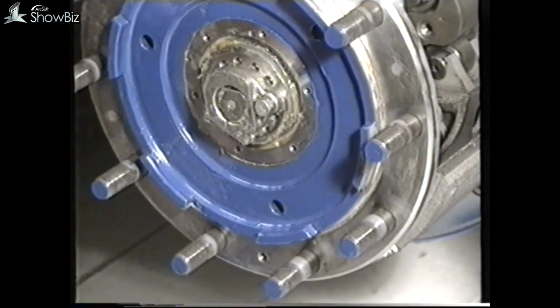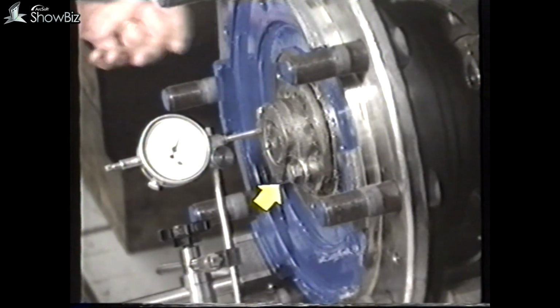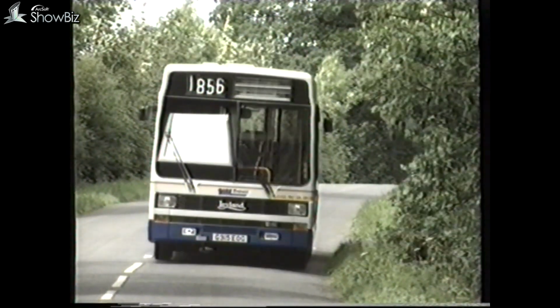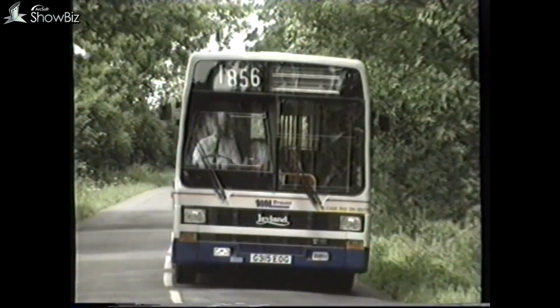After tightening the clamp bolt, recheck the clearance, as the clamping action on the stub axle threads may have moved the clamp nearer the bearings, thus reducing the bearing clearance. If so, the initial clearance will have to be set wider to allow for this take-up. It should be noted that operating the vehicle with insufficient clearance or a preload on the bearings will reduce the bearing life considerably.